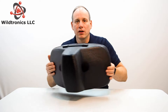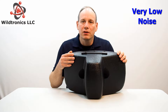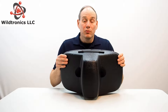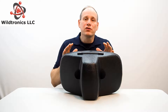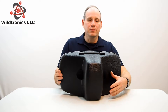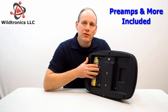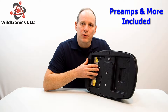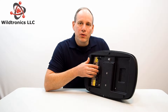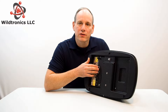There are two microphones included that are very low noise. With only 8 dB of noise floor, they will allow you to capture even the quietest of environments. But the SAM is more than just two great microphones — it includes an electronics package that will allow you to connect almost any type of recording device. Very low noise preamps are included for both the XLR and 3.5 mm outputs, providing up to 46 dB of gain.